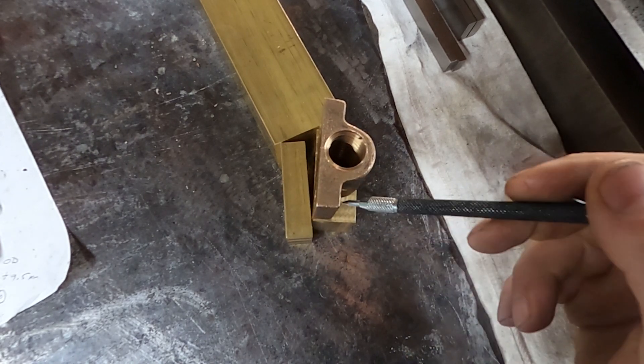The drilling all went really smoothly. The only downside to this faceplate setup was the step blocks actually propelled chips of brass all the way across my shop into every little nook and cranny you could ever imagine. Even though I knew that the faceplate setup was 100% secure, I still maintained my area down at the tailstock region of the lathe the entire time. Once I got to 43/64ths, I then started the Acme tap on the lathe itself. I did this so that I could finish it off by hand, which I also forgot to record.